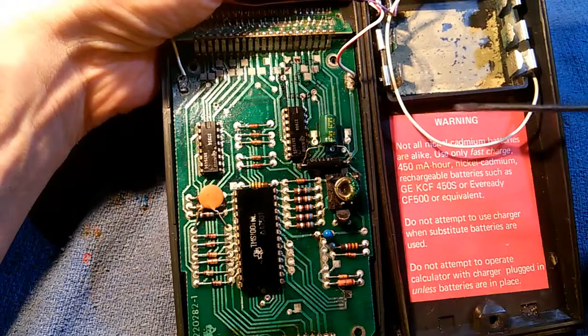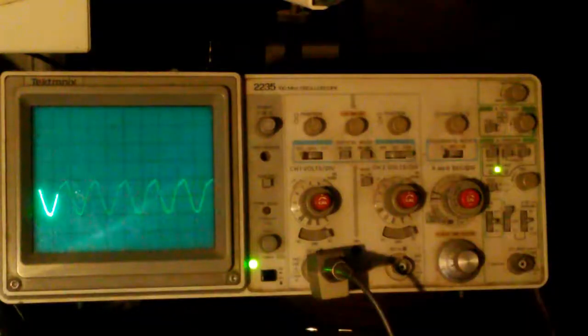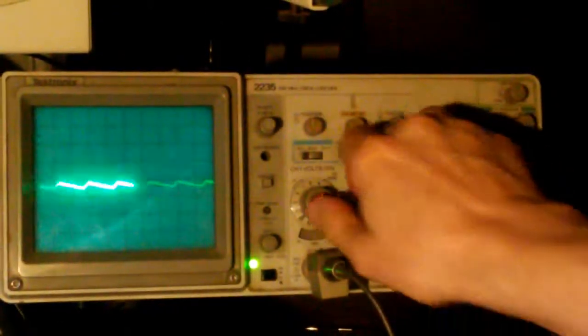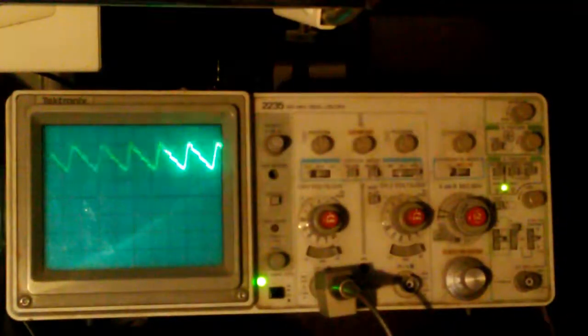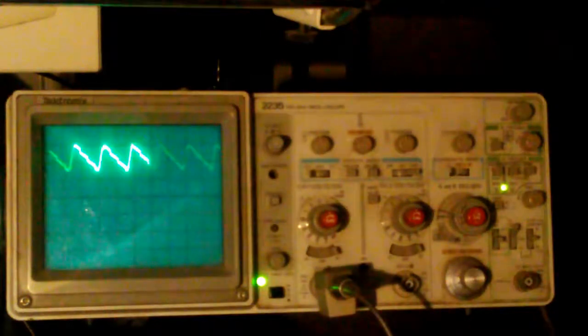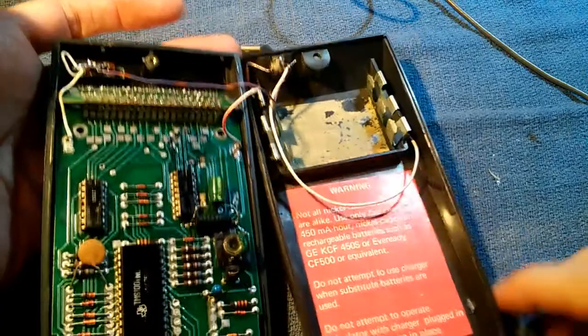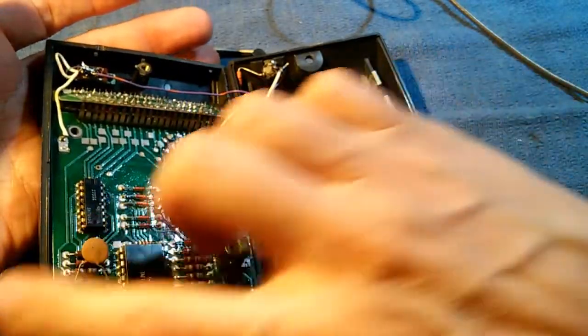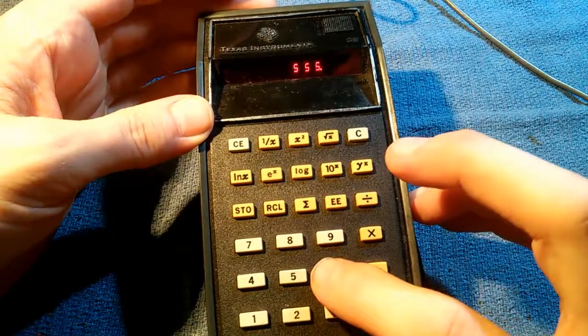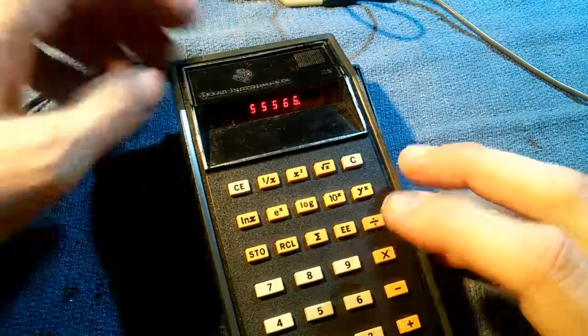It's flush with the circuit board so I can close the top over it. Here is the waveform before the diode and after the diode. We're on 2 volts per division, so our voltage is maxing at 8 volts and down to 5 volts — quite a sawtooth, indicating that this thing is really pulling a lot of power. These early LEDs were very power inefficient compared to current generation LEDs. With our new capacitor in place and without batteries, it is functioning on the AC power supply.